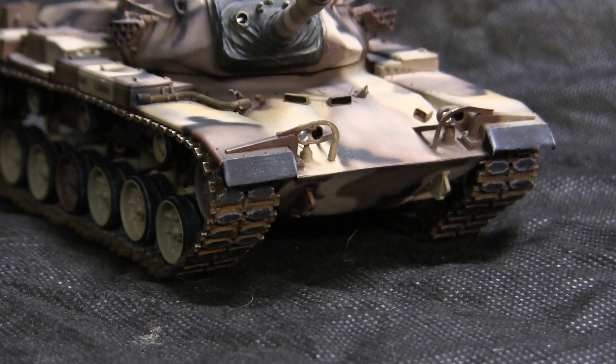Another benefit of the T142 octagonal link was that it was non-directional. Unlike the chevron tracks, where the tank would drive by and you could look at the imprints on the floor and know which direction the tanks were moving, with the octagonal link it's ambiguous. You're not sure which direction the tank was moving, which aids in concealing the movements of your tanks and your forces.